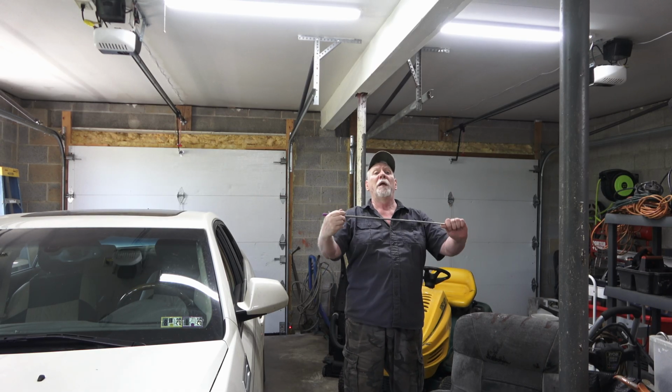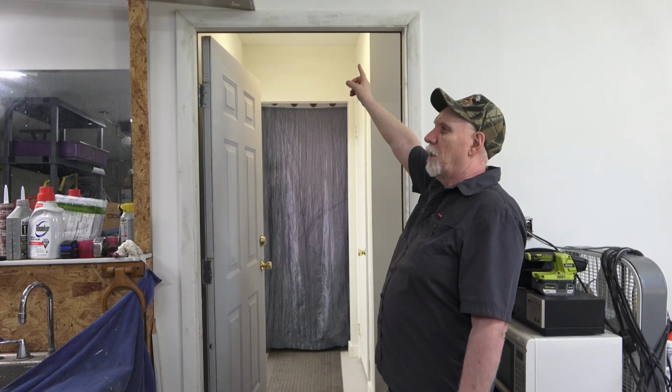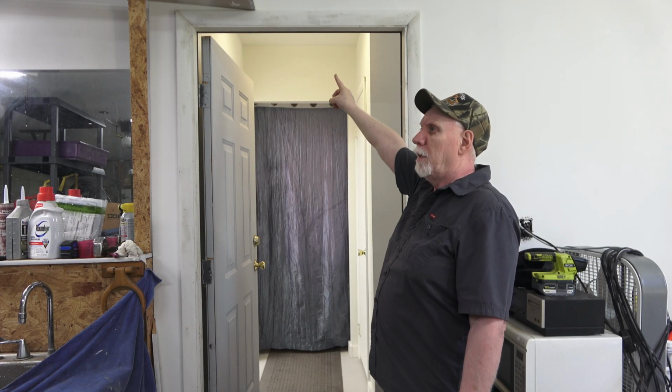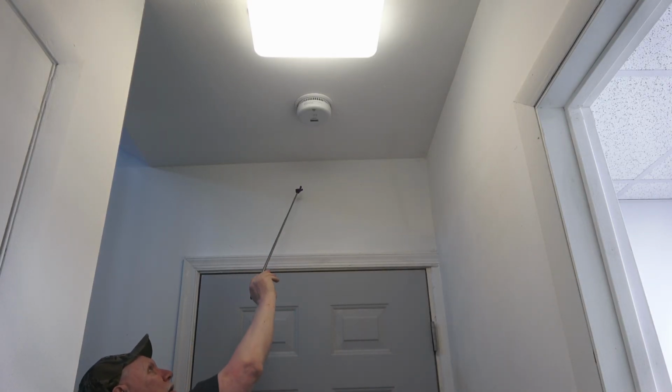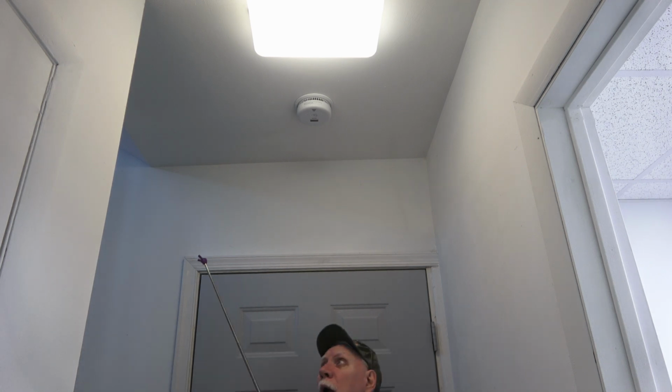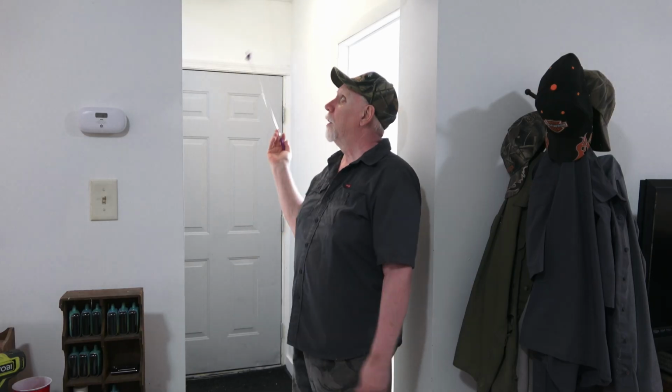So, the place they suggest to install, just inside the doorway, on the wall, ceiling. I'm 19 inches out, 16 this direction, and this is the hallway leading to the upper level. Here's the theory. Pellet stove over there, carbon monoxide detector here, in case something goes haywire with the stack. However, I didn't put the smoke detector in the same room because they're very sensitive, and you open and clean the glass on the door and dust. So it's installed here in the hallway, just outside the garage, the one we just looked at.